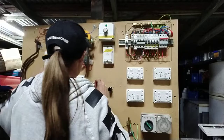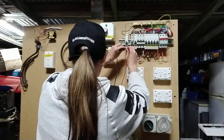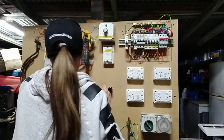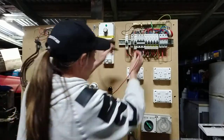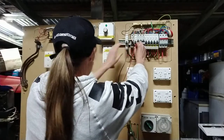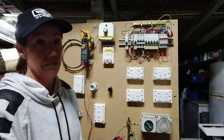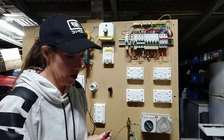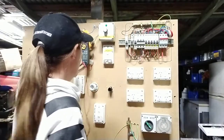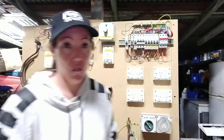The sub main shows nothing. My hot water system also shows nothing at the moment. I'll turn it on — and I have a reading now: 16.3 ohms, which is pretty average for a water heater. I can also check the hot water circuit when it's turned off — nothing. That confirms you're toggling the right circuit on and off, and those are the values you'd expect to get.